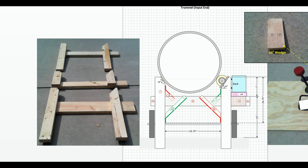To build the frame, the first thing I did was cut all the wood pieces. For sets of pieces that require the 55-degree angle — for instance, where the pillow bearing mounts to the 2x4 — I would make all those angle cuts at the same time to ensure that the cuts are the same, as well as the cuts for the idle wheel.